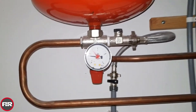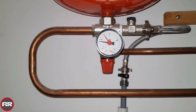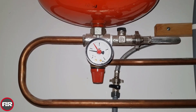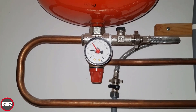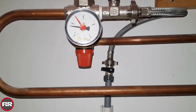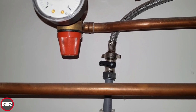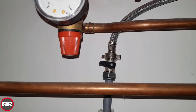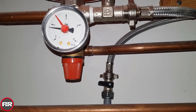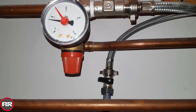This gauge is a pressure gauge. You've got a sealed system, so you need to get it topped up a little bit more than what it is now — it wants to be just over one. Where the red needle is, you need the black needle to be the same. What you do is turn this lever to 12 o'clock or 11 o'clock slowly, and you'll hear the water going. Watch it until the black needle meets the red needle, then close the lever back to the position it's in now.